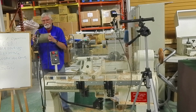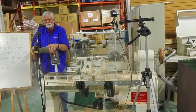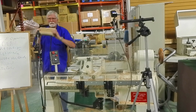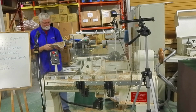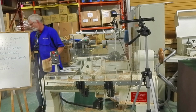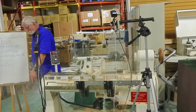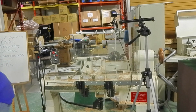As you're cutting in like this, since the blade's going down, it's gonna wanna go like that. And as you're coming out the other side, it's gonna come towards you. And it'll probably bend your blade. Any questions about that? Anybody didn't know that already?